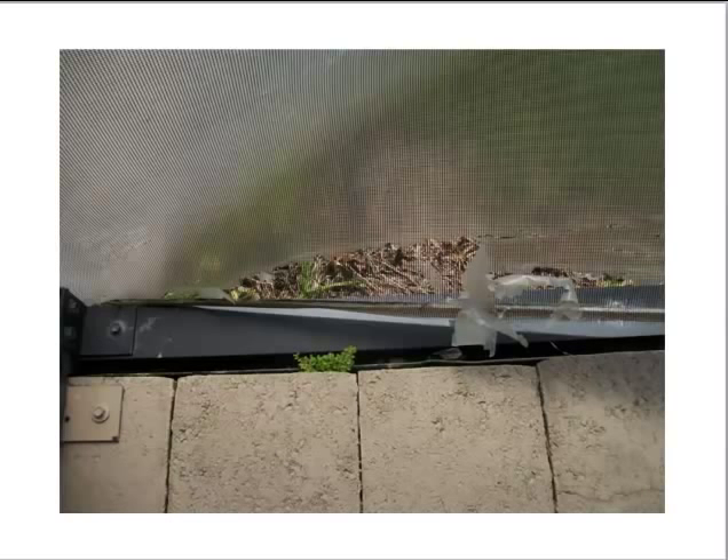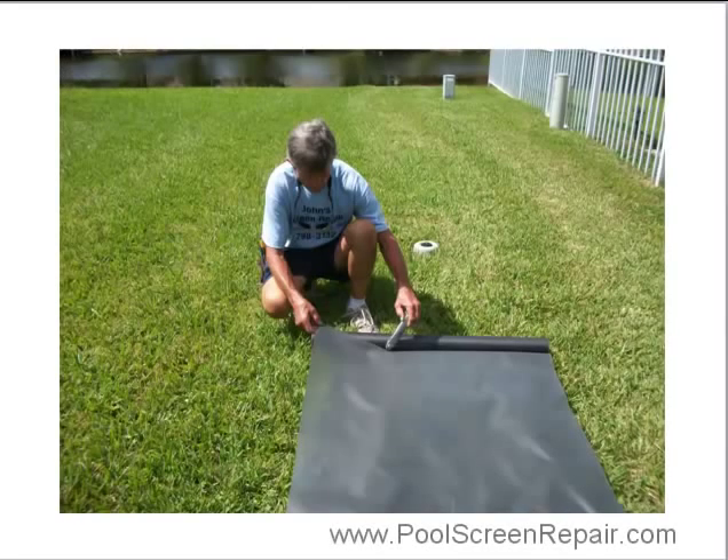Now what he's going to do right now is put a patch on this hole right here. This is a laminated screen, which is the reason why it's sort of peeling, and I'll show you that in a minute. You clean this up — it's this kind of screen. For practical purposes, any kind of fiberglass screen, the patching is all the same. This is the screen that's laid out on the grass and John's cutting it with some sort of cutting device. It looks darker because it has a laminated plastic over the screen.